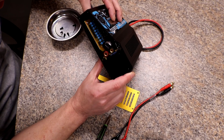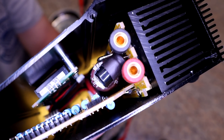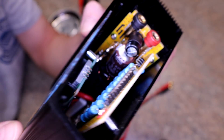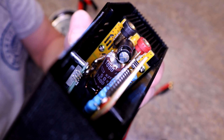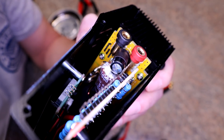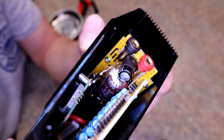If you look very carefully, that first capacitor — it's a little swollen. Can you see that? And if you look at the capacitor behind it, that one's a little swollen back there too, and it looks like it might have oozed a little bit. But it looks like that first one might have oozed a little bit too. Alright, well, that looks like an easy fix, at least so far. We'll pull it all the way apart and see if there's anything else wrong with it.